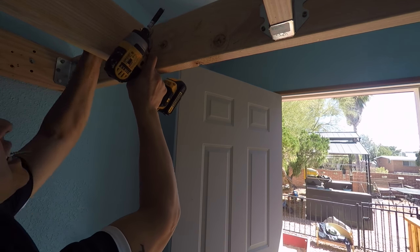The wood flooring ended up perfectly flush with the top of the one-by face board — pure luck. The last step for the laminate is applying wood glue along the front edge of the last row on the bottom side. It doesn't matter if it's exterior or interior glue for an interior project — I had exterior on hand so I used it. I ran a bead all the way down, clamped it down, and let it harden without touching it.